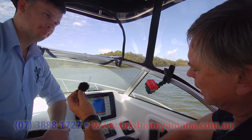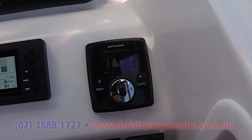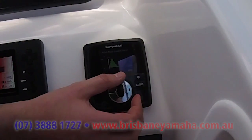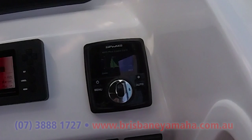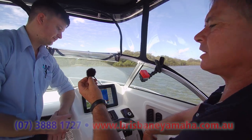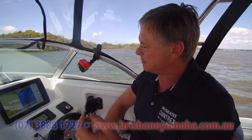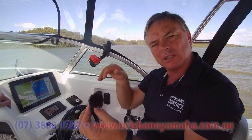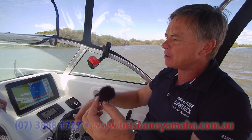Auto setup is pretty straightforward — speed over ground gets you out of the hole onto the plane quicker using the pitch curve. The pitch curve is generated by entering your boat data: boat length, boat beam, boat weight. From that, the brains of the ZipWake calibrate the pitch curve, which is fully editable. The 705 has a very low planing speed, so up to about 6 knots there's nothing on the trim tab, then at 7 knots you've got 50% extension to pull you out of the hole, keeping you flat with minimal bow rise, then it backs off once on the plane.